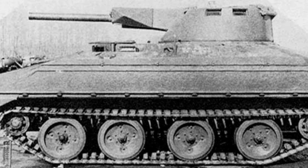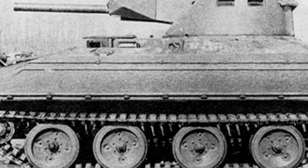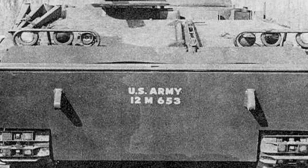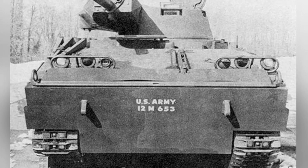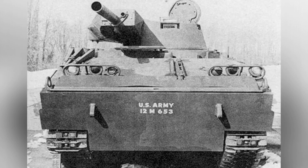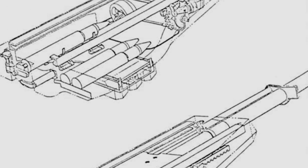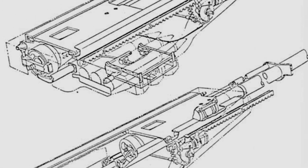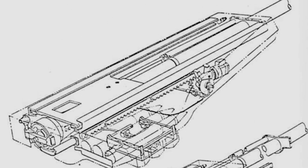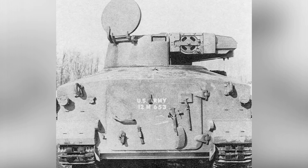The T-114 is equipped with a small-sized rotating turret on the vehicle body, with a 106-millimeter recoilless gun mounted on the right side of the turret. This gun uses a three-round clip-loading system and can fire three rounds in a few seconds using armor-piercing shells. When the crew places the three-round clip, mechanical gears drive the teeth below the barrel, pushing the barrel forward to clear the rear, while the loading mechanism grabs a shell and brings it to the breech. Then, under the action of the gears, the barrel returns to its original position, loading the shell into the chamber.